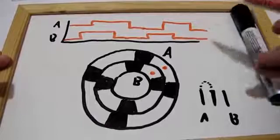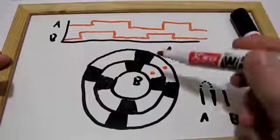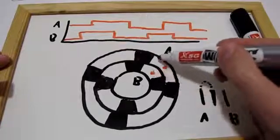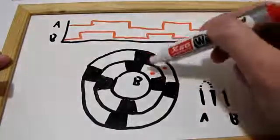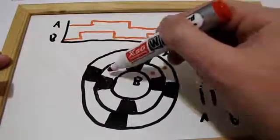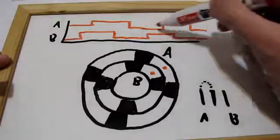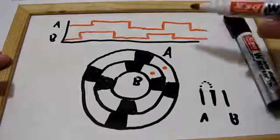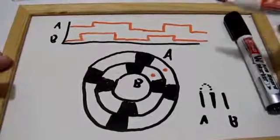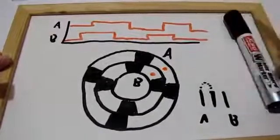The pattern for a counterclockwise rotation is just the same, except in reverse: A will touch the black area first, so A rises first, then B, then A drops, then B drops. I said it goes down to zero, but that's not accurate because I said just disconnect — so it's floating. That's why I had the pull-down resistors outside the contacts. But that's the pattern we have.